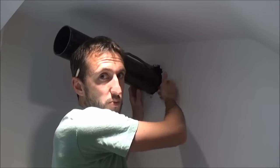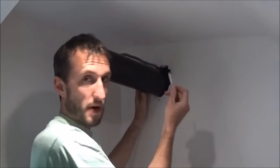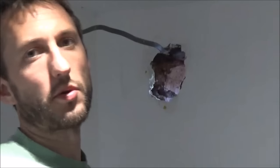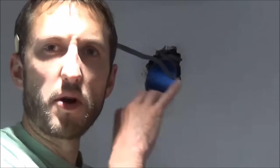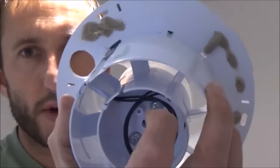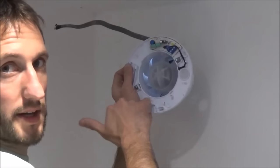Going outside to do measurements, I'm making sure the duct runs flush with the wall and flush with the grille on the outside wall. I've got the pipe lined up outside flush with the wall and the outside vent, marked it with a pencil, and cut it flush. I've cut the piece of pipe to use for the vent. I'm putting a dollop of grip fill on the back of the extractor fan because one of the holes is a little bit loose — this will just help firm it up to the wall with no movement. Then offer the extractor fan into the duct, making sure it's the right way up using the level line.